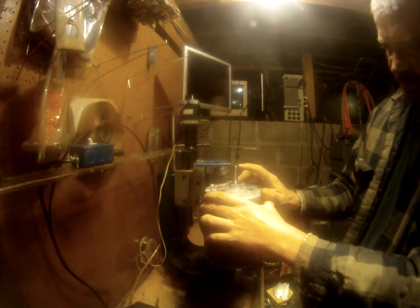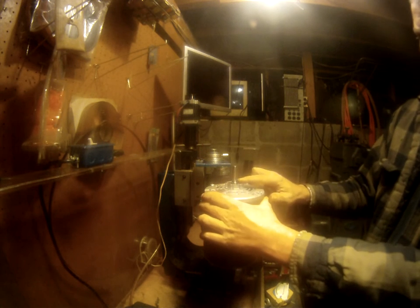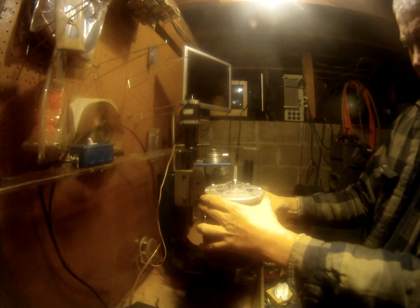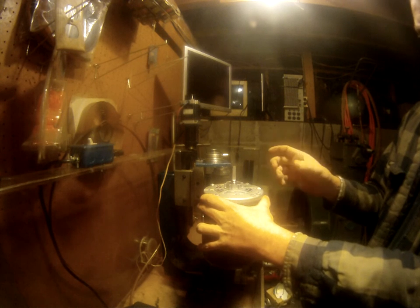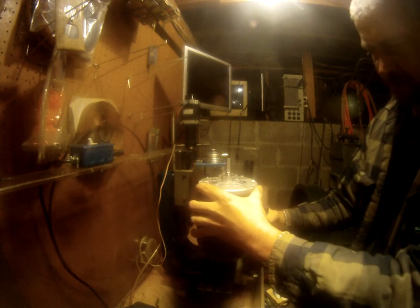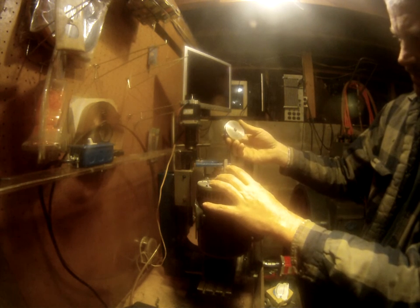Another thing I have to do is change the pulley. Instead of buying a pulley and hogging it out, which wouldn't be too bad, probably not that expensive, I'd rather just set this motor up, probably on my lathe. I think I can strap this motor down to my, what are they called, ways on my little lathe, and set up a tool post grinder. Yeah, and just grind this down till it will accept that pulley. And I think that's what I'm going to end up doing. Hopefully it leaves enough meat. I'm sure it'll leave enough meat on that shaft that it'll work.